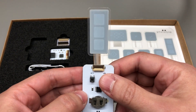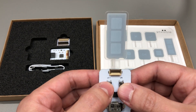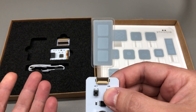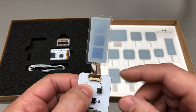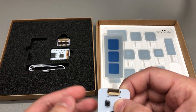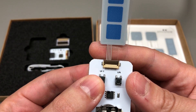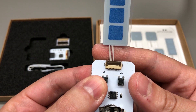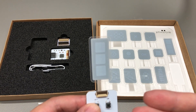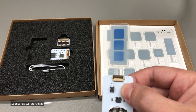We have two buttons on the demo board: one for coloring the segments and the other for bleaching them. There are two things I noticed immediately. It does take some time for the cells to change color, but it's really simple to drive these — you can connect them directly to MCU pins. For example, this 3-segment display has 4 pin connections: one common pin and one connection for each segment. You drive it with a high or low signal to go from color to bleach state, so you start to imagine how this can enable some very low-cost devices to be built.